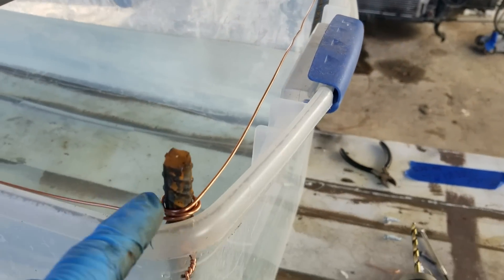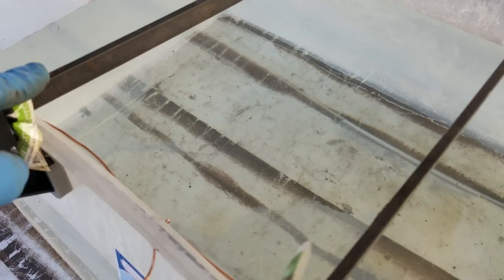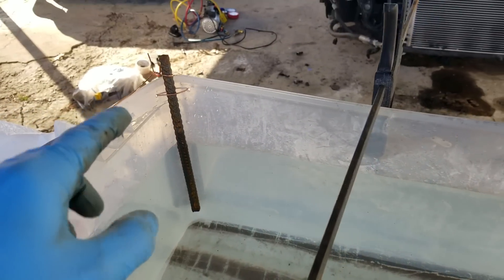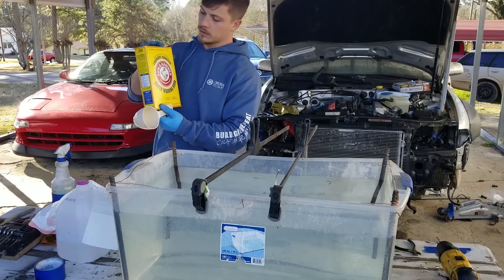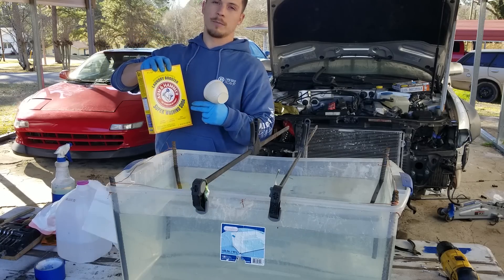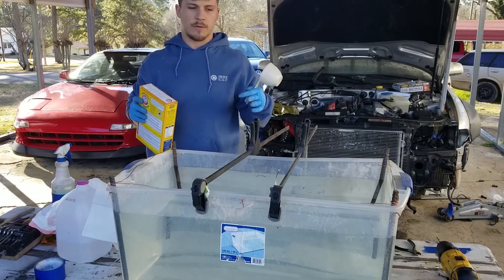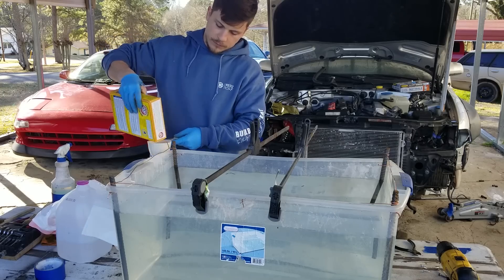So this is the setup I'm using. You can see everything's tied in with copper wire. I've got a guide down here to hold my wire in the right spot so it doesn't touch these metal clamps, and it runs over there. This setup is done. Now the next step is to add washing soda to the mix — not to be confused with baking soda. This is sodium carbonate, and baking soda is sodium bicarbonate, so they are a little bit different. We're going to add a half cup per five gallons; this is about 10 gallons of water, so we'll go a full cup.